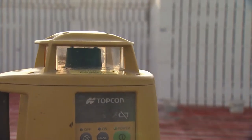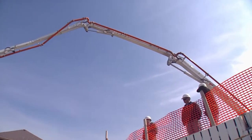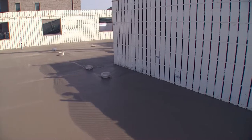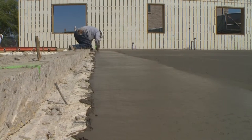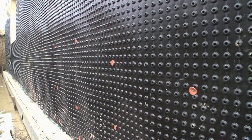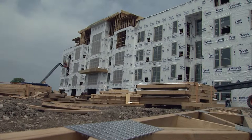From the foundation up, you also have to treat the foundation the same way. You're going to have the structure — concrete, or block depending where you're at — and then insulation, maybe not as much, because the ground is not as extreme. Say you're five feet down, it's 55 degrees, not minus 10. So you don't necessarily need as much insulation, but you still want to promote drainage. This is a drainage fabric — the crinkly side goes up against the wall, the other side goes against the insulation. If you get any water behind there, you're going to have a waterproofing membrane on that foundation to keep the water out. This drains it down into your weep tile, or if you have daylight, it takes it outside.